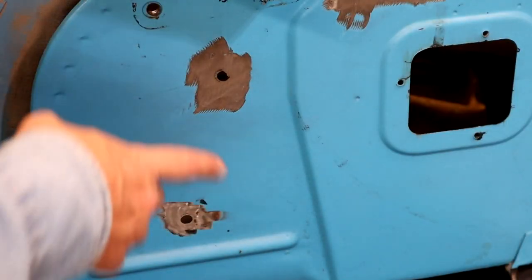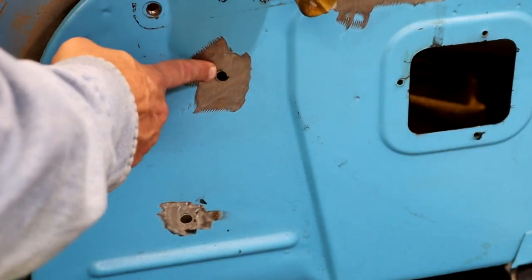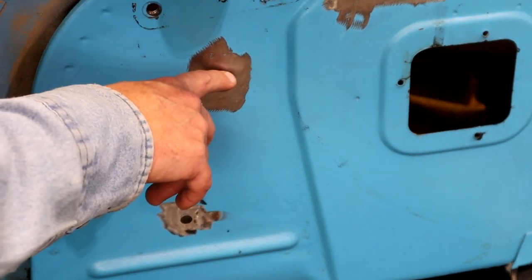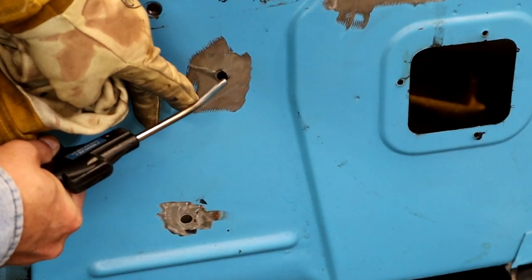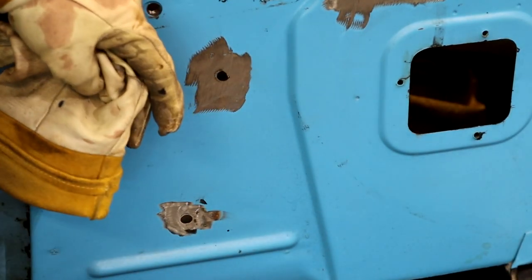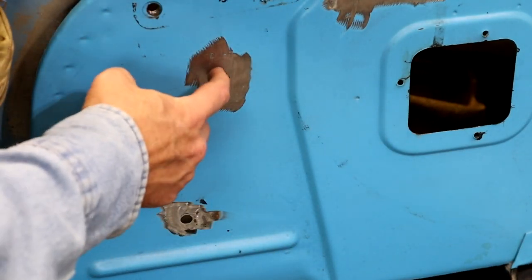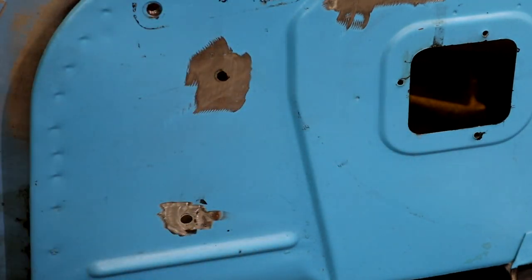All right, now guys, I'm gonna show you that you can fill it without a backer. Say you get into a pinch and you just can't get to it. Sometimes it happens. So I'm gonna show you on this one. So what we're gonna do is we're gonna start and we're just gonna, like about half of it here, just zap, zap, zap, and just go around the outside edge and just basically build a ring around it. Then we'll cool it off, and then we'll come back and just go to the inside of that ring until it's totally done. We'll grind it off, and I'll show you it can be done.